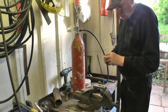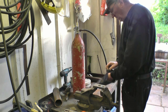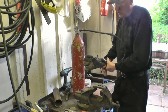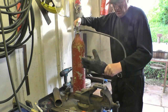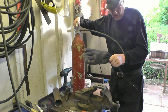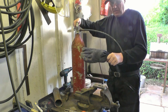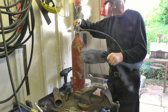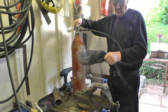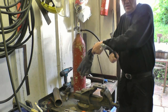I've all set up to do this — put this shrink fit together. The first thing I want to do is cool off the pin. I've got a little carbon dioxide fire extinguisher here. I'm going to put some carbon dioxide into this welding glove and that will cool the pin down, basically form dry ice and cool the pin down. The expanding CO2 will cool the pin down. It does help a little bit. That's severely cooled in there now.